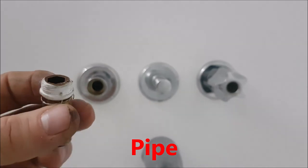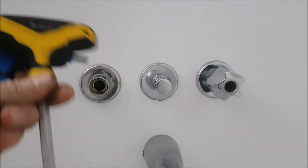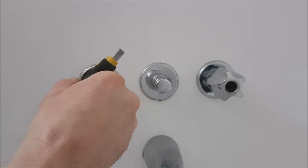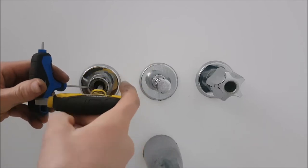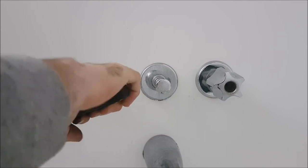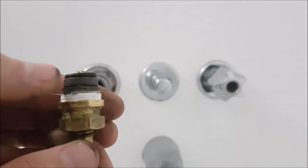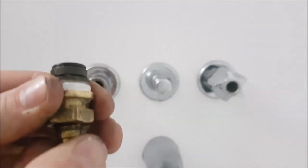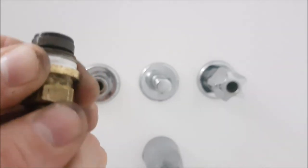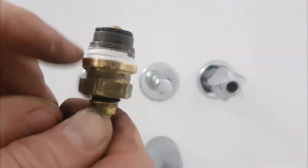This valve has come out of the wall. I just retaped this piece and we need to figure out how to get it back in. We have our 5/16ths or 8mm allen key — both of these fit down into here. Use a smaller T-handle, slide it all the way in, and use another T-handle to hold it in place while you get it started and spin it in there nice and tight. Make sure your valve is all the way open — when it's open it allows you to get more threads into the pipe before it seats against the seal.